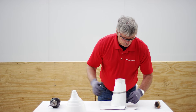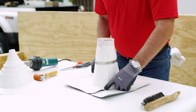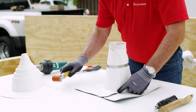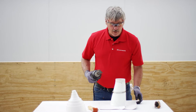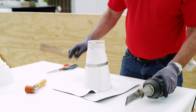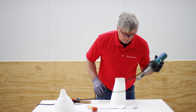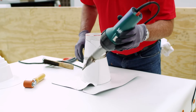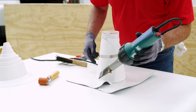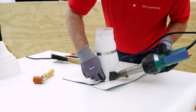So what you want to do is: before you weld anything, get it how you want — nice and neat — and slide it to the pipe. Now I can do this angle change and this vertical, and I have something to push against. Now this is reinforced membrane — it's going to take a little more heat than unreinforced material. A little trick I like to do is lay a little heat on the outside of this; it won't stretch much, but it'll give me a little play so I can make sure that angle change is nice and tight. Then stick the gun back in there and do this angle change first.